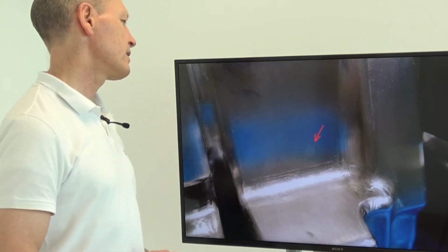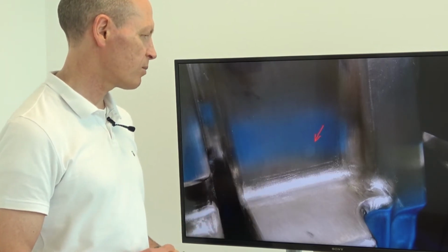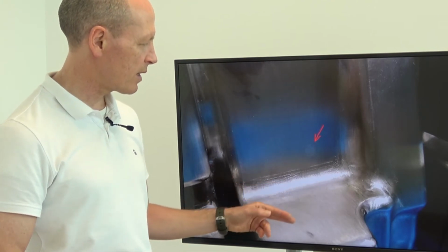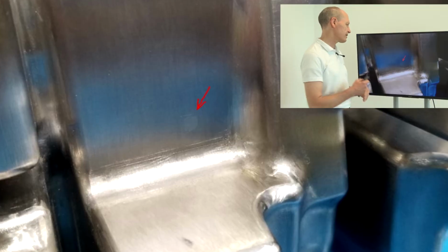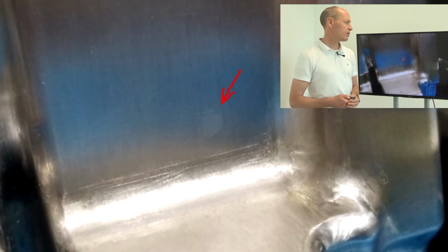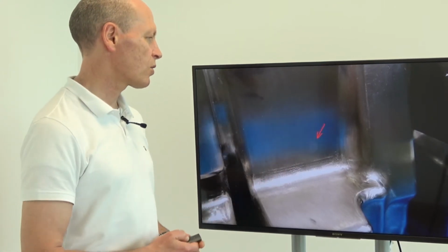welded the sensor in the insert, and this was a CVT sensor that provides fast reaction data in contact with the aluminum. Thanks to that we are able to see the surface temperature of the insert and detect the metal front arrival. Thanks to those signals, we were able to discover phenomena that are not intuitive to think of. And by designing the insert taking into account the sensors, cost can be reduced.